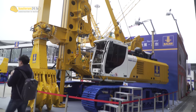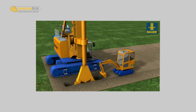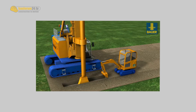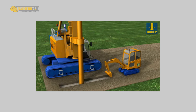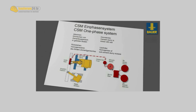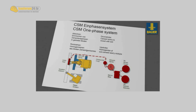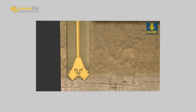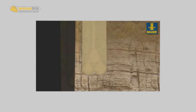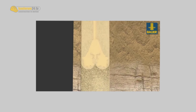What is the purpose — what is the application for CSM? CSM is cutter soil mixing. Like someone making concrete takes gravel and sand and mixes it with cement, we take the soil — the earth underneath the ground — and mix it with cement slurry. We then form a continuous body of soil-cement mix, which can be used for sealing off underground flow of water or contaminated water. It is a very efficient method because we can use the existing material.